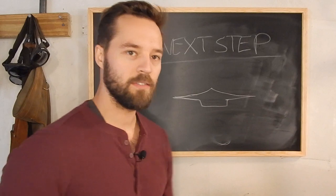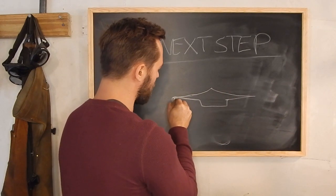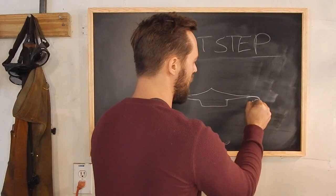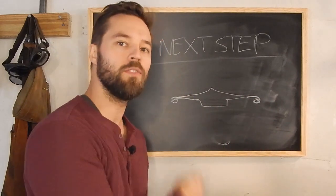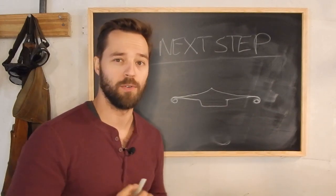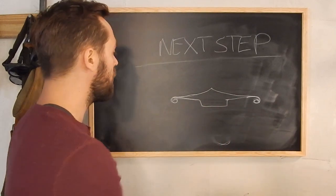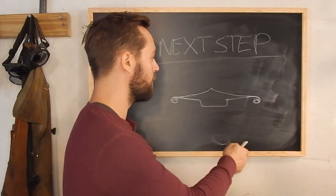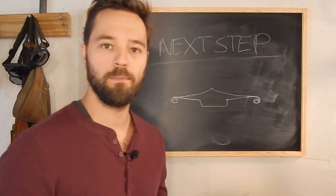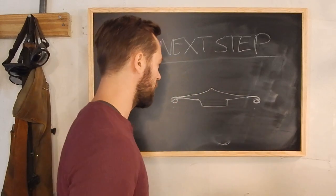Taper cool piece, and we're gonna curl these ends down. Curl them down. Whoop and whoop. It's easy. Use a pair of scrolling tongs or tap it over the edge of your anvil around your horn. There's a bunch of different ways to do that. You should explore all of them. In fact, here, you can explore two of them. Do one with scrolling tongs, and do one over the edge of the horn of your anvil. Great, look, problem solved, we learn new stuff.